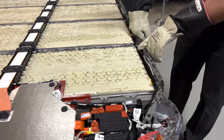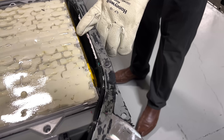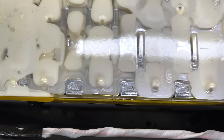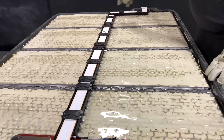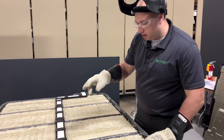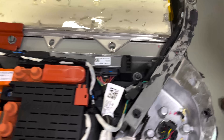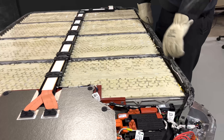I also want to take a closer look at these laser welds. It looks like they're still dialing in their system because some of them have burned through — shooting through the aluminum and the base of the aluminum connector. So that can be cleaned up a little bit. The BMB strip running down the center holds all the electronics — it's pretty efficiently packed. The little BMB boards are underneath this as well. The one thing I found a little annoying is they have this one wire going along the outside, which might be the most efficient way to pack it, but it could have also just run underneath to save a couple cents on fasteners.